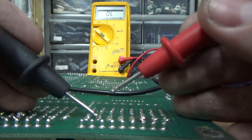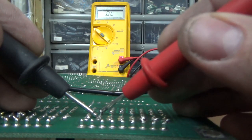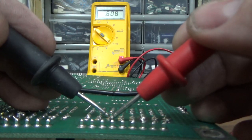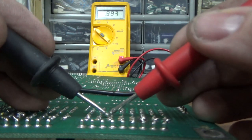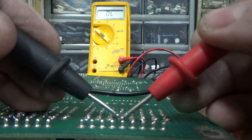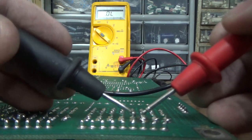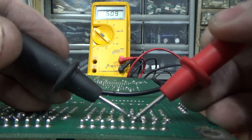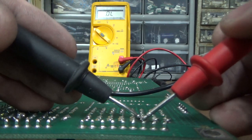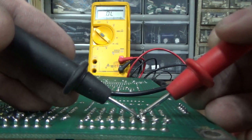So think about it. Can it be a bad wiring thing? Nope. Can't be a bad wiring thing, people. Because when you ground the tab of the transistor, it works. So ground gets all the way from that little transistor all the way to the coil. Well, all the way to the flasher. And it did it over and over and over again. I checked it over and over and over again. Definitely was working.